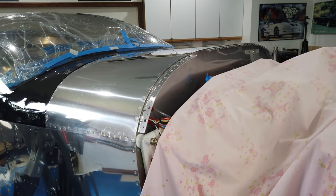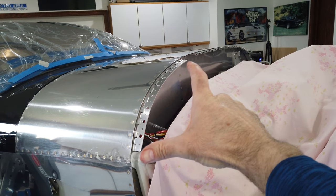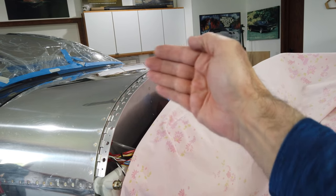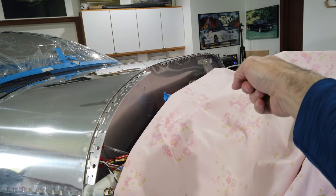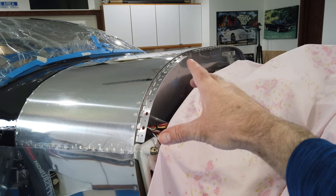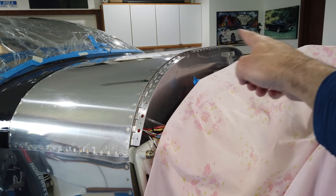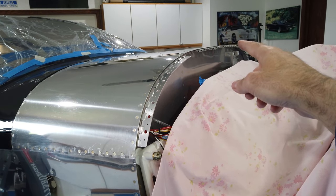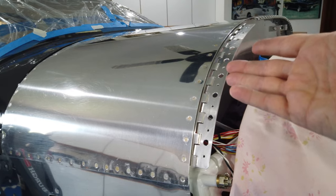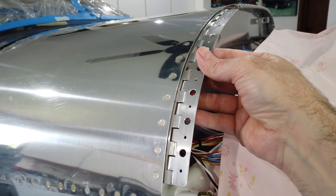I've been working on this hinge — doing the short piece first. This piece is quite short, and then this hinge here is actually quite long, starting past halfway and going all the way across and down the other side. I started with the short length first because I figured if I screw it up, I'll have plenty of hinge length left to make a new one and still have enough to do the long one. The hinge is in place — no hinge pin yet — all I had done was drill it and pre-bent it, and it looks pretty good.